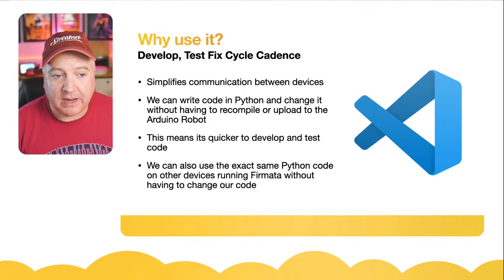Okay, so what we can do now, this is a very uninteresting program, but it does mean that we can try out some code. We're going to say, how many times would you like the LED to blink? And then we'll read that into loop times. And then we will say blinking loop times times. And then for x in the range loop times, so whatever that number is, write 13 high. And then sleep for, what's that, a fifth of a second. And then write low, which is zero. And then sleep for another fifth of a second.